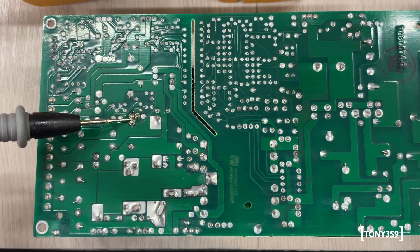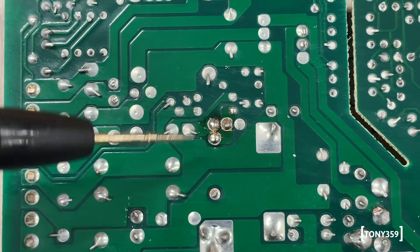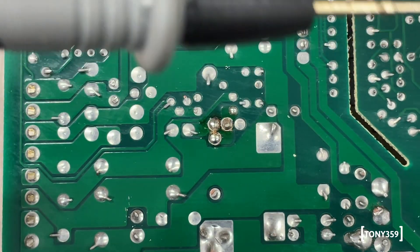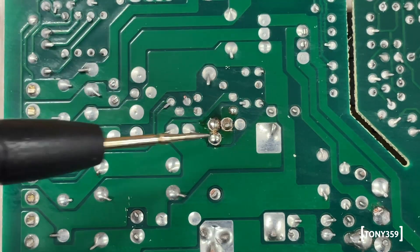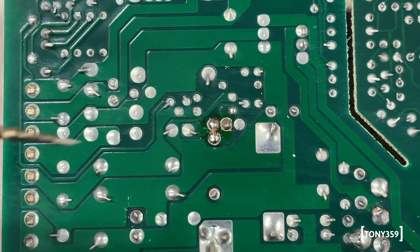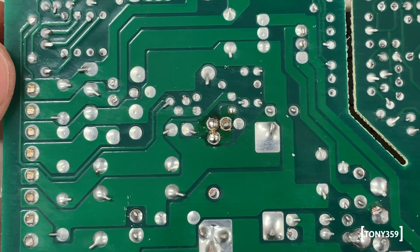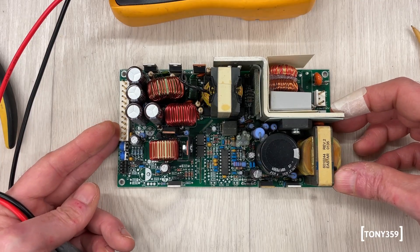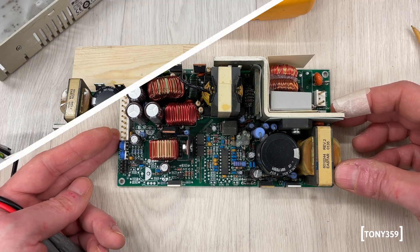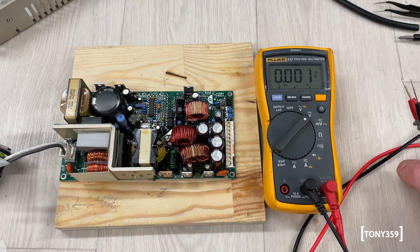The only thing I see is that someone has reworked this component here, but it must have been at the factory because to remove the cage I had to cut the factory label. So I guess this is some kind of factory rework — unless it melted when something shorted. I'd say let's power it up through my current limiter and see what happens. Mains is connected, it's not running at the moment, and I'm ready to power up.